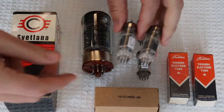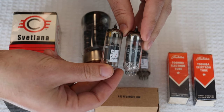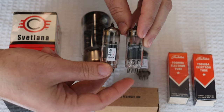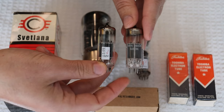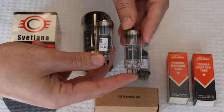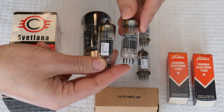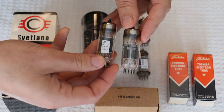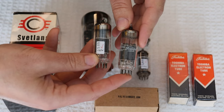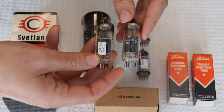And we've got some more Japanese tubes here. These are the Toshiba 6CG7 or 6FQ7s. And these, of course, are 6SN7 equivalents in a 9-pin bottle. We've got an adapter somewhere around here. Actually, I think we might have just used it on the other amp. Yeah, I'll go grab it. Keep going. Anyway, these are great tubes. They'll work in any spot designed for a 6SN7 with the right adapter, of course. And we've just been hearing great things about them constantly, so we're always trying to get more in.